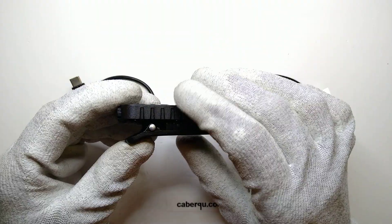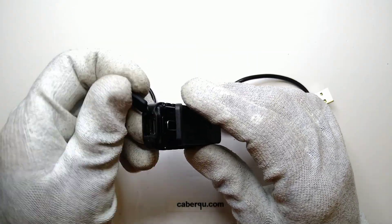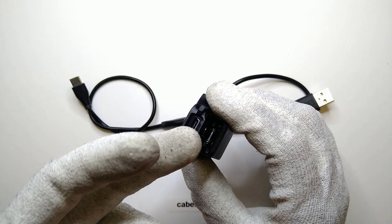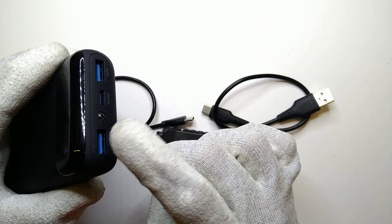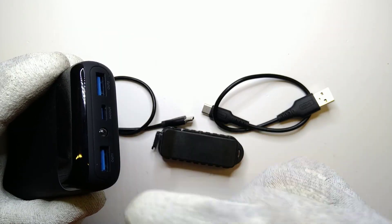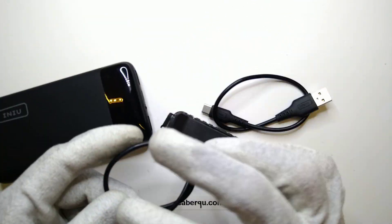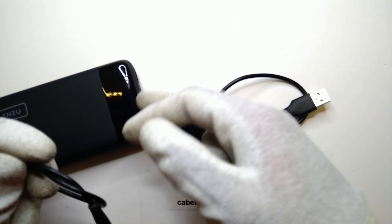So that's off. And besides this weird blinky light, I found out that they've actually wired the USB connector wrongly. And while you have no way of seeing that from the outside — so there is no way of actually knowing what's going on in there without disassembling it — I've brought in this power bank to show you. This power bank features both USB-A as well as USB-C out and inputs. The USB-A ports are outputs only and the USB-C is both an output and input. This is due to the fact that USB-C cables are interchangeable — you can plug it in like this or like this — and the devices themselves can then agree on which direction the power is going to flow, whether this power bank is going to charge the device or if it is getting charged by a device.